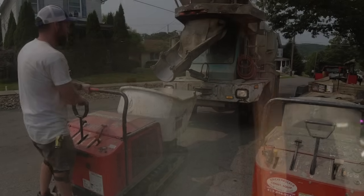Let's head underneath. Okay, one final inspection in here. We ran a center brace, and then from header all the way to the floor. Now this lumber can always stay here. This can, of course, come out in about 28 days.